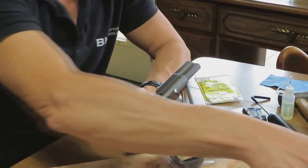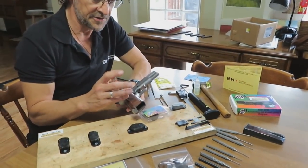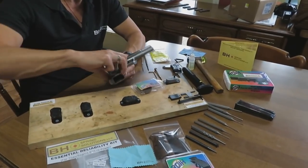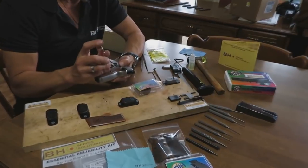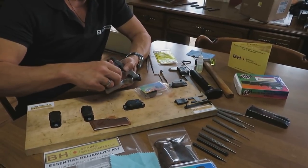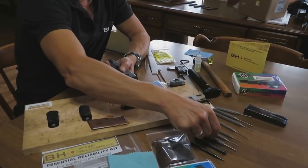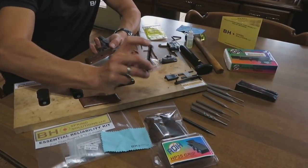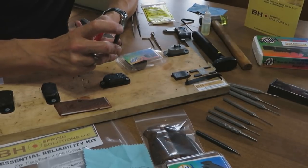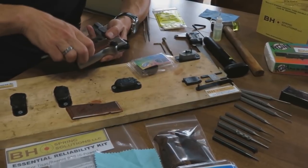Here on the table are our master's pin punch tools for high-power pistols, including 3/32nd roll pin and standard pin punches, 5/64ths — which is the right punch for many of the pins in high powers — in both standard and roll pin versions, 5/64ths and 1/16th standard and roll pin punch versions. Also a 3/32nds nail punch for stage one of trigger pin removal, a rubber washer-protected 3/32nds cupped-out head punch for stage two, and a 1/16th starter punch that saves your 1/16th pin punches.